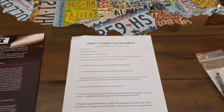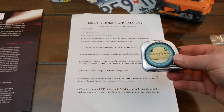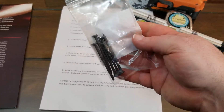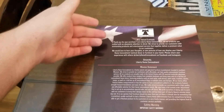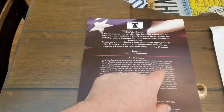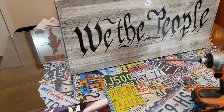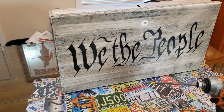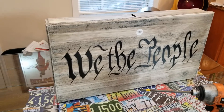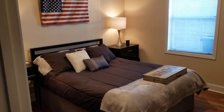The directions tell you everything you'll need to mount this: a number two drill bit and drill or impact driver, a tape measure, a level, and a stud finder - very simple tools. They include the mounting screws. Inside the case there's a thank-you letter and their mission statement, which mentions they also make coat racks, wall mirrors, quilt racks, mantles, clocks, lamps, and concealment flags in multiple sizes. The products are made in America, and they try to source materials from the U.S. whenever possible.